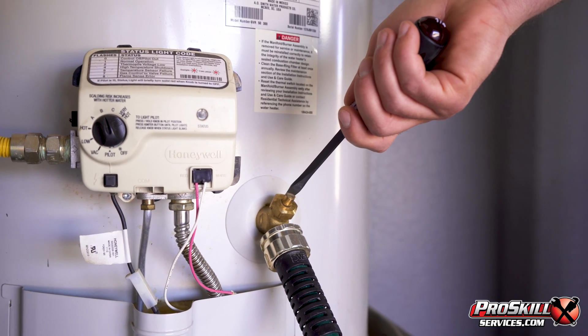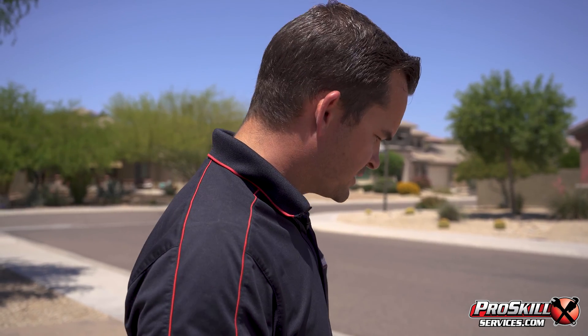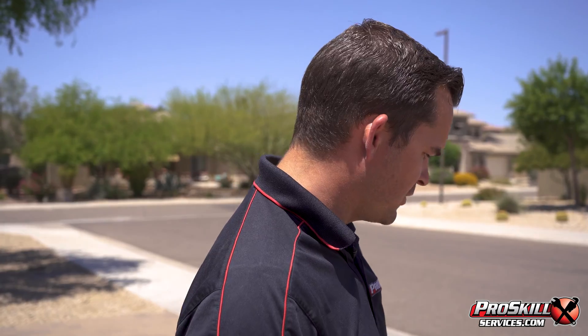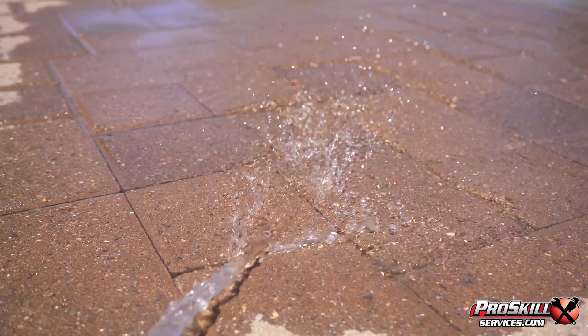We're going to go ahead and open it up and see what's coming out. What we saw right at the initial burst of water was just a little bit of rust — or possibly just dirt — but it wasn't a lot. The water is coming out perfectly clear right now, and I'm not noting any white globules, which would be sediment from the anode rod breaking down. This is nice and clear — nothing I'm really worried about. We're going to shut the water off; we really just need to identify if there's anything at the bottom. If there was a lot of sediment, we'd let it run until it cleared up, which can be anywhere from one to five minutes.